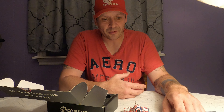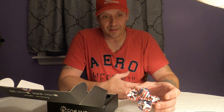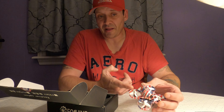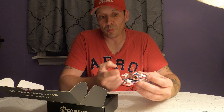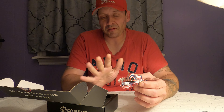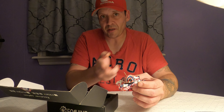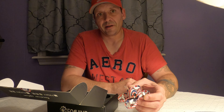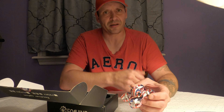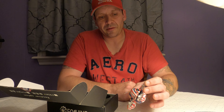I kind of screwed everything up — I pooched it all. I had to go back and reinstall everything back into the quad from scratch. Only two motors would turn at a time — I'd throttle up and nothing would spin, or I'd roll left or right and just two motors would spin. So I had to go back into BetaFlight and change a pile of settings that I had messed up myself. I've actually got the quad flying again in air mode, but there's still a bit of work to do in BetaFlight.